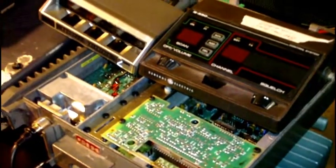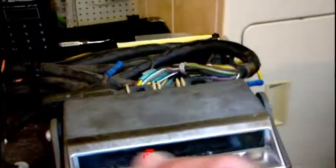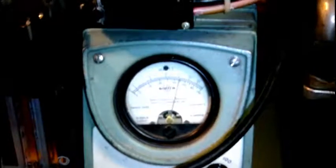I'll go ahead and give a demonstration of the radio transmit and receive. The radio is powered up — you'll need a 12-volt power supply, probably eight amps or so for this model, but for a full-power one you'll need over 20 amps. The control head is set up on channel two. Let's give a demonstration of receive with my handheld — test one two three. There's your receive on simplex 146.55. Transmitting into the dummy load now — coming up just shy of 50 watts on this old Philco Sierra watt meter.